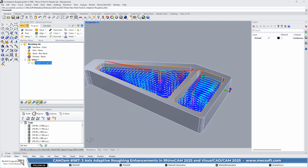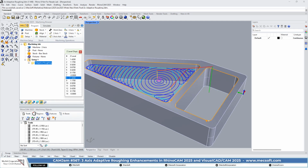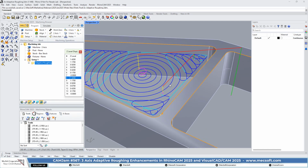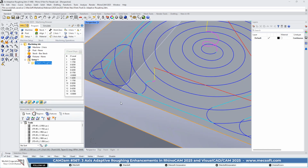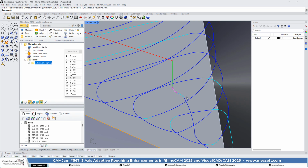It's a roughing method. So let's take a look at the view toolpath in levels display. So we've got each one of these levels. Let's look at the first level here. As you can see, we have one helical entry at each level, but you'll also notice that we have a retract and a transfer to pick up some more material over here. In the retract, we have an arc motion, an arc motion, and a retract motion, okay? These arc motions facilitate the high-speed cut pattern itself at higher feed rates, and we also have arcs on the re-entry over here.